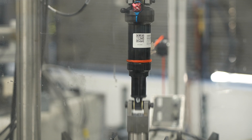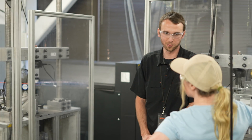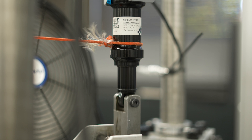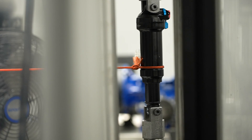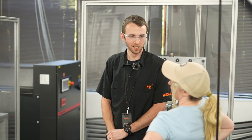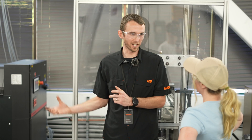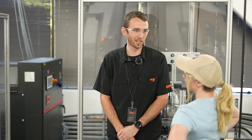We have similar trail recorded profile tests for rear shocks. On this one you'll notice there's a string hanging some weights over a pulley, applying a side load to the shock. Depending on the frame, that side load gets introduced, and we want to see how the shock holds up to that.